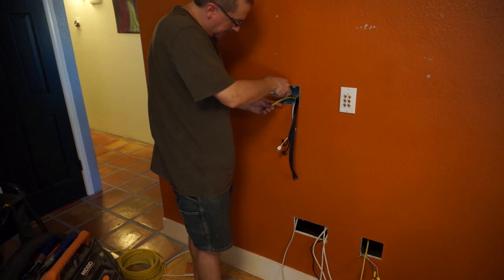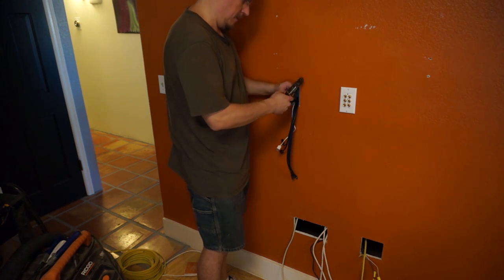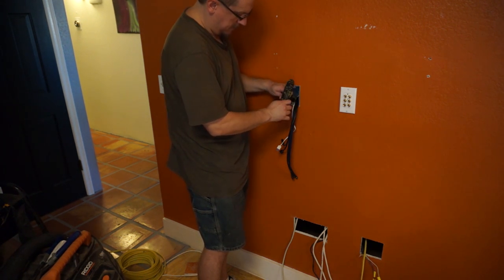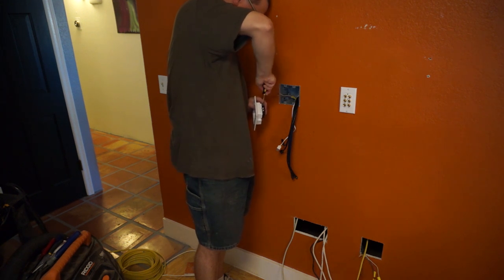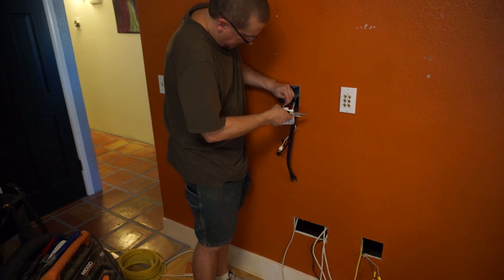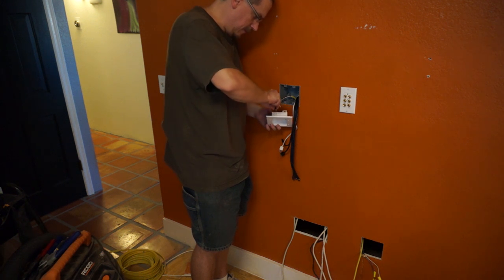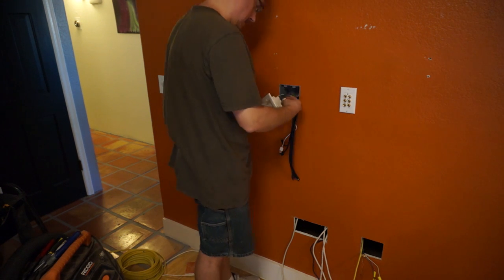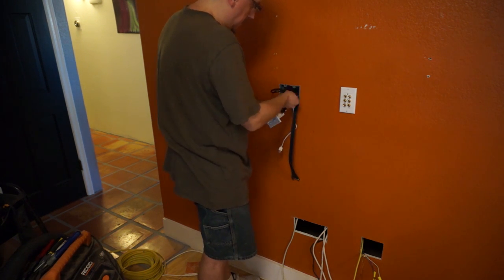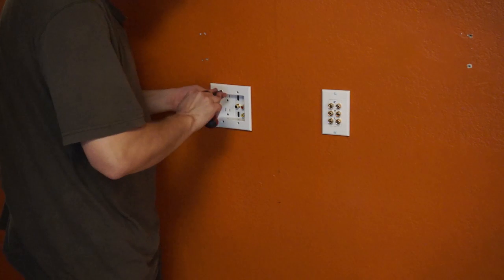This is the terminating connection, so the wiring is exceedingly straightforward. I strip off the insulating sheath back to the clamp, then strip off just enough on the hot and neutral wires to curve around the post on the outlet. I hook up the ground first, then whichever post is closest to me next. The way I remember which wire goes to which post is via this saying: black connects to bronze. That is, the hot wire connects to the bronze screw and the neutral white wire to the remaining silver screw. The alliteration of B's in black and bronze sticks in my mind. The AV cables then just plug into the back of the keystone jacks on the panel — no special splicing needed. Trivial! I screw the plate into the outlet box and voilà — my two upper boxes are done.